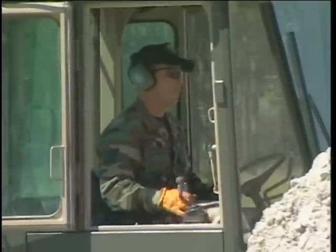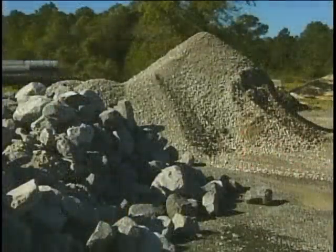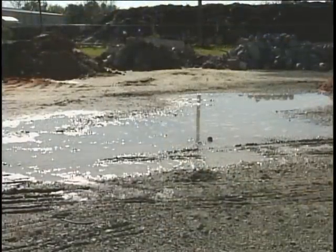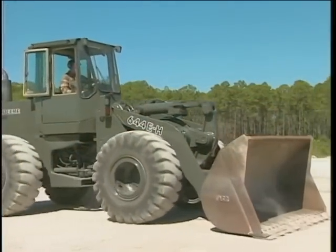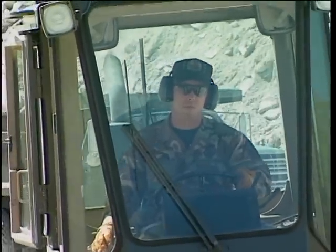The wheel-mounted front-end loader works best in soft to medium material. When the material is virgin earth or medium to hard-packed material, this loader's efficiency is reduced. Likewise, efficiency is lost if the area has poor drainage and poor underfoot condition. Lack of operating space also greatly reduces this machine's productivity as well. A flat, smooth surface and plenty of space to maneuver can peak the loader's efficiency, provided the operator is proficient in the task at hand.